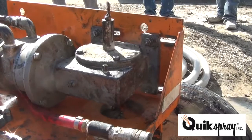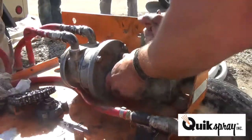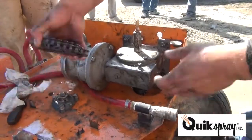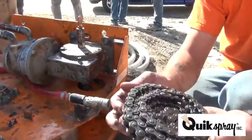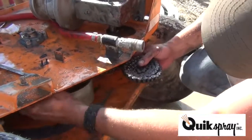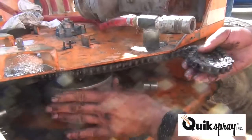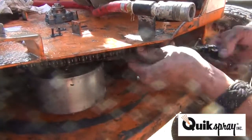He just load it right in the blue dot. Alright, so it's still loose enough. You can move it forward and backwards for the chain adjustment. So what we're going to do now, we got the chain lubed, put in a circle, hook it on the big sprocket. You can see why I put it in a circle, it makes it real easy. You roll that around.